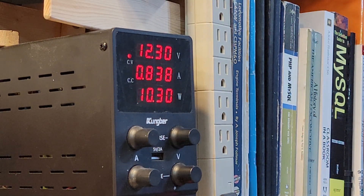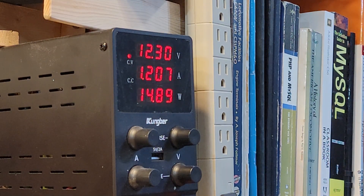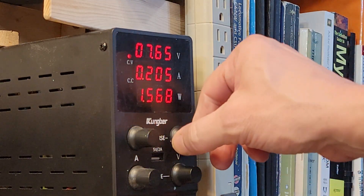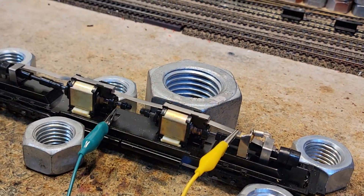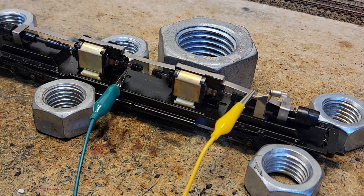Let's see what else we can try. We'll never have that much load on normally — that's just one motor and they run independent. What I want to do is find a way to stall both at one time without burning my fingers. There it is — 1.7 amps if they're both stalled at one time. So we're running at about 1.7 amps under heavy load.